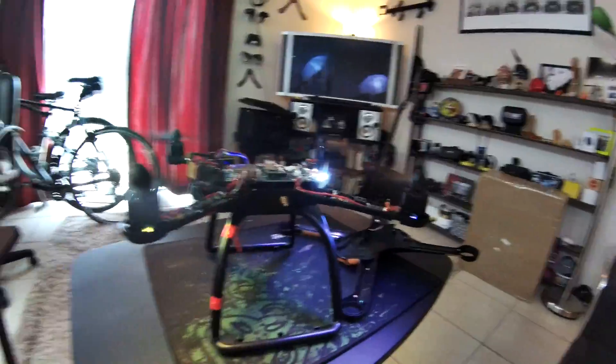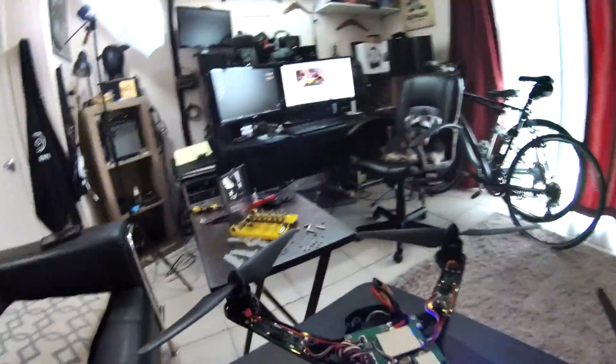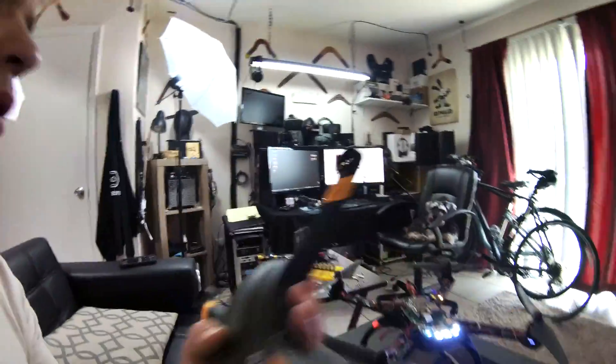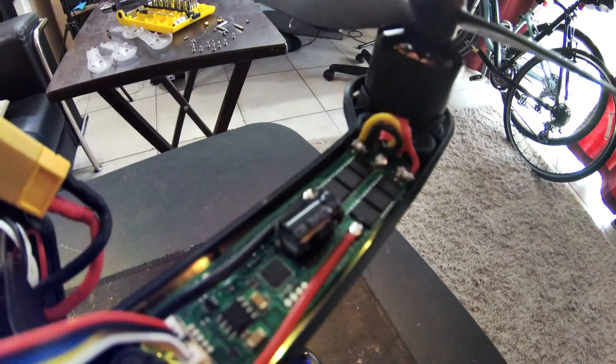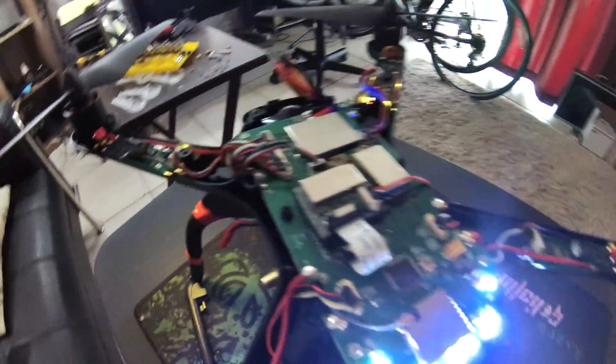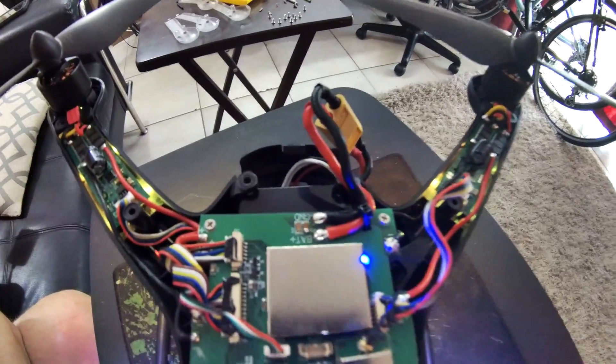Just so you can take a look at it, I'm going to turn the blades off. All I basically had to do — we'll go ahead and look at the soldering job I did. For the A motors, it's yellow, black, red. Over here, another A motor — yellow, black, red. And then over here for the B motor, we have black, yellow, red. And that is the connection setup for them. It does seem to work just fine.